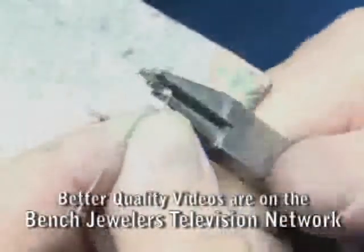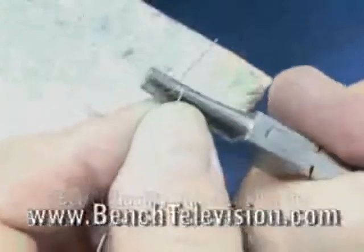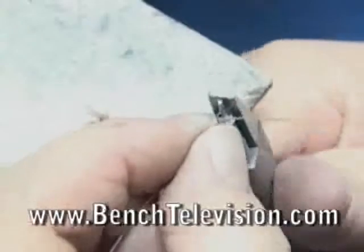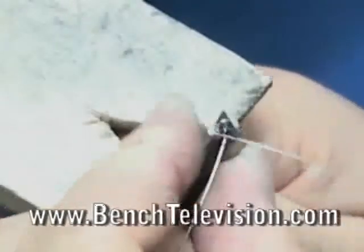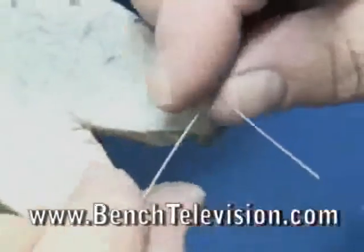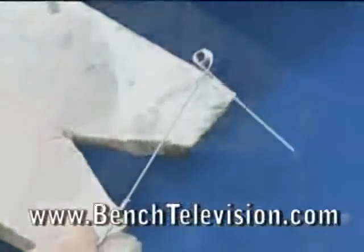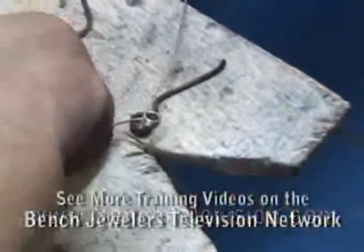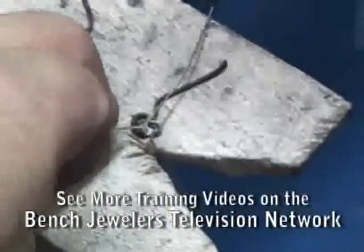It takes quite a bit to bend this — just keep coiling the spring around. These coils are what cause the spring action. Continue wrapping it around to get two or three windings around the center. Measure it to the old spring to make sure the angles are correct, and then start to make the other bends.